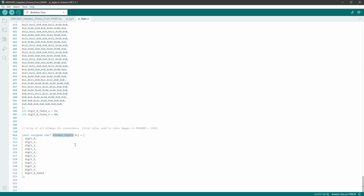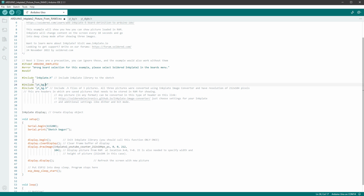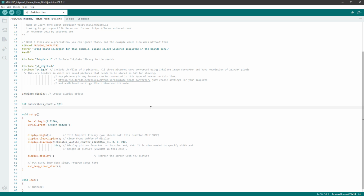reference those images. Back in our main sketch, we need to make sure to include those digits, so include YouTube digits. And let's create a few helper variables. One of the type integer will be called subscribers count, and let's hardcode this value for now, for example 223. We also need a helper string that will be the array of characters, and let's call this subscribers count string and use for example up to 10 different characters.